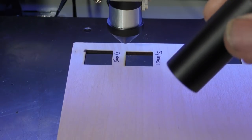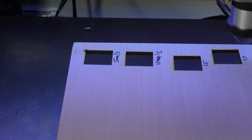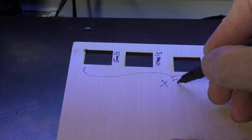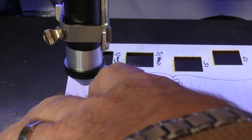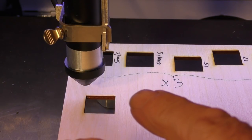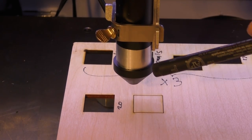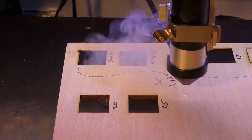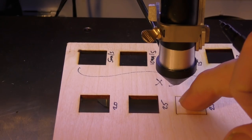So I've now swapped this times 3 for a times 2. We've seen where times 3 bounces off the wall. In fact, it bounces off the wall here at 18. It won't deal with 18. Let's just have a look at what happens now when I continue this run. Times 3. Nothing else other than change the beam expander. I haven't reset anything, except that's 20 millimeters a second. That's 27, which will not push out.